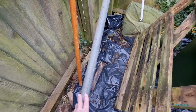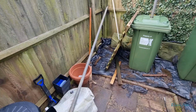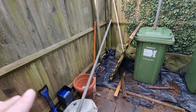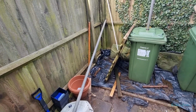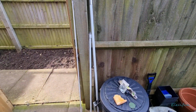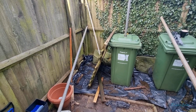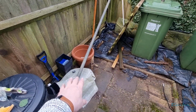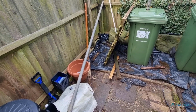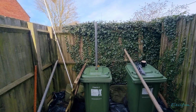on this pole. And that's 12 foot. That'll go 3 feet into the ground, concreted in, and then this 16-foot one can be bracketed to what's left, the 9 foot coming out the ground, to give me a bit more height. And that's what this antenna will then go on, because it'll all be coming into ground as well, because I'll make sure there's plenty of soil around the top of it connecting to this pole, so it's like it's going into ground. I need to do a conductivity test on the pole, but as it's made out of metal, I'm pretty sure it'll be conductive. So anyway, let me get this thing put up and take a breath.